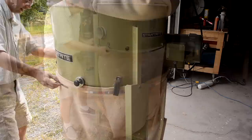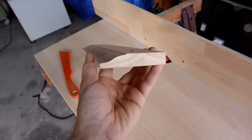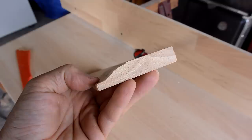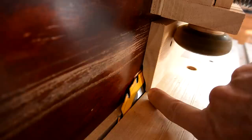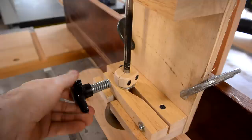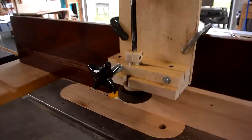I figure this sort of profile would look nice on the baseboards, and I can cut that with a raised panel router bit on this improvised router table. But before I cut these, I figured it would help to cut away much of this material on the table saw first. I have a thin kerf ripping blade tilted to take away much of the excess material, and to help feed it through, I improved my improvised feeder gadget — it now even has a knob for adjusting downward pressure. Still powered with a drill, still using a roller skate wheel.